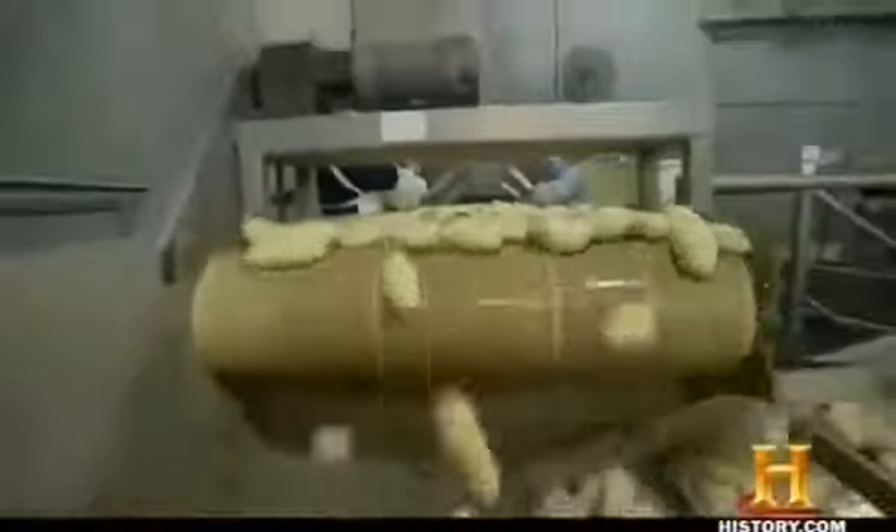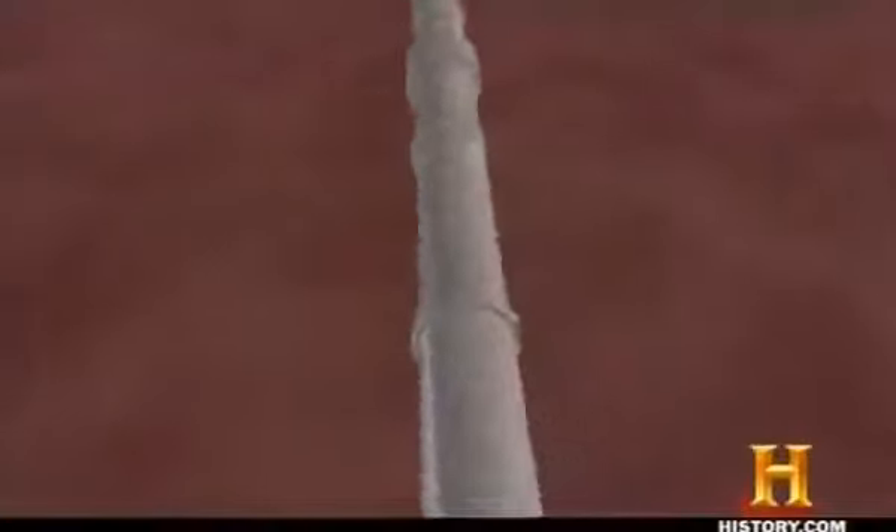Workers scrutinize the load and trim away any foreign material, defects, and generally ugly bits. The potatoes are then once again separated by size in preparation for the water cutter. The water cutter is basically a potato cannon — water pumps through it at about 50 miles per hour. The pressure forces the potatoes one at a time through the pipe toward a stationary grid of blades. One whole potato goes in, 100 potato strips come out.